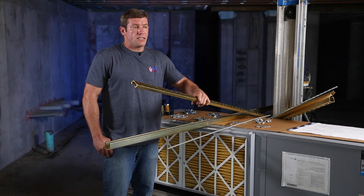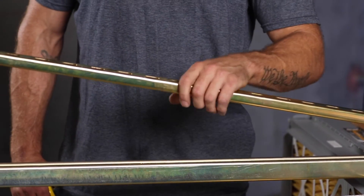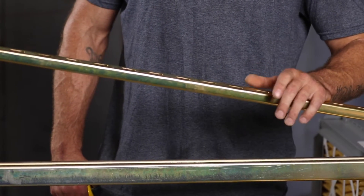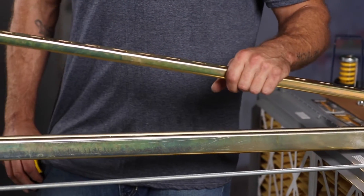Right here we have 13/16 inch unistrut and we have inch and 5/8 inch unistrut. Make sure you're using the right unistrut for the amount of weight you're suspending, because if you go under you'll end up with deflection which is the warping of the material in the center. So the longer the span, normally you need to bring it up to a stronger material.